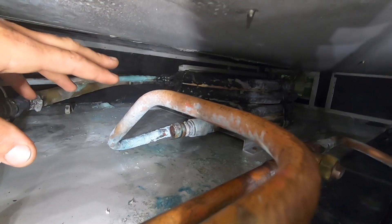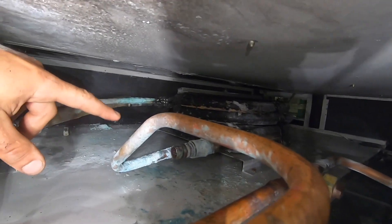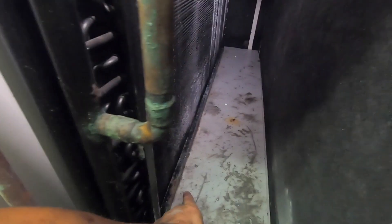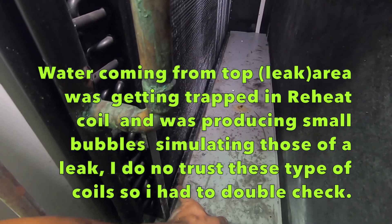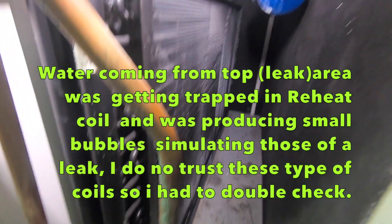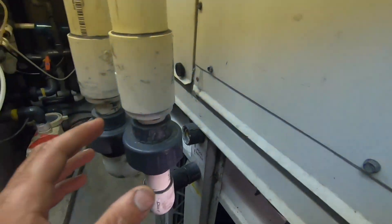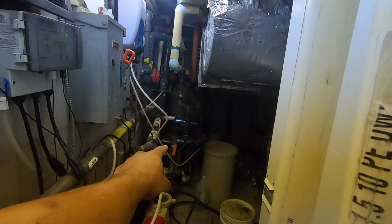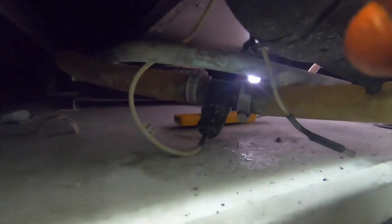You've got refrigeration discharge going in and pool water going in as well - they don't touch each other, they're just heat exchange. You've got copper going all the way through this metal coil - it's called a coaxial. I also got a look at this reheat coil, another refrigeration coil, and I was seeing bubbles down here. It could have been water trapped coming out of the coil or it could be a leak, so I'll check that out too with my gauges. These are the evaporator coils. These are the two lines going in for the water - they go back to the pool pump.